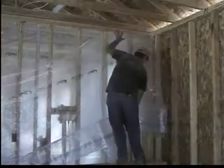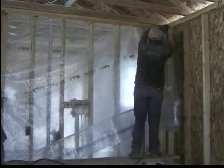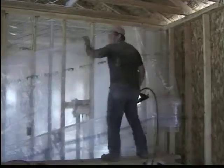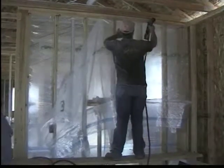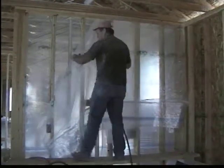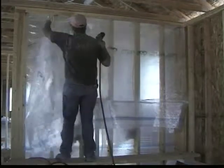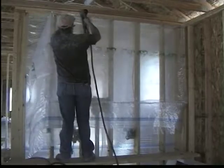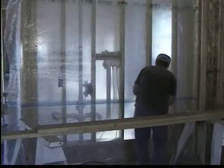This is a double wall application which is used by builders, especially in large custom homes where laundry rooms and lavatory facilities are on the inside of homes. It gets a double wall poly application, lip stitched on both sides. Note that the plumbing and electrical are encapsulated between the envelope of Parpack reinforced vapor barrier poly.